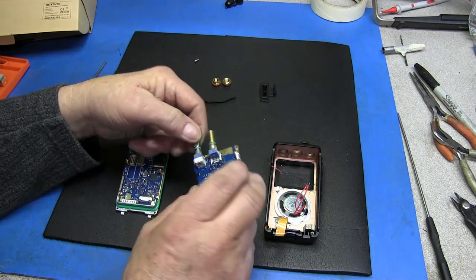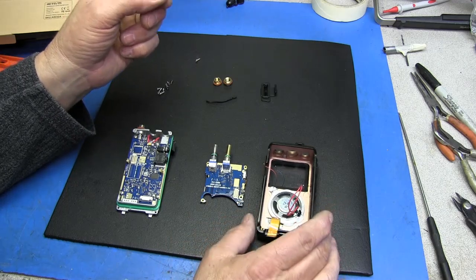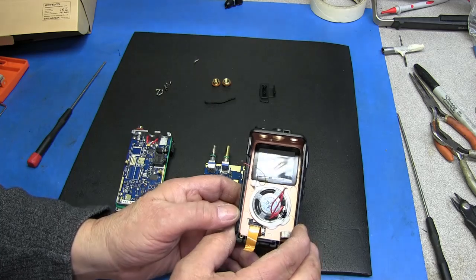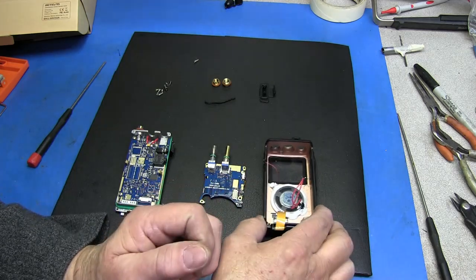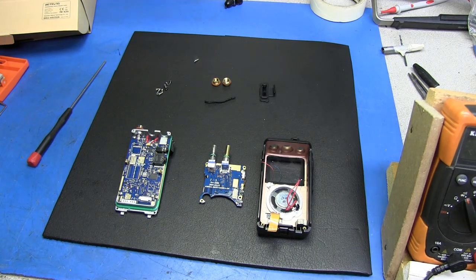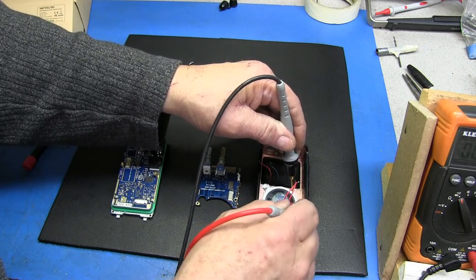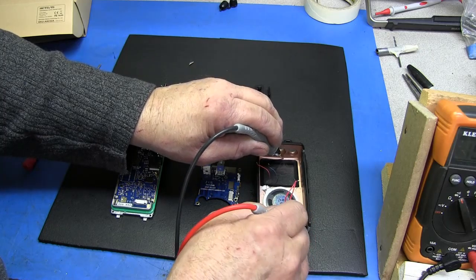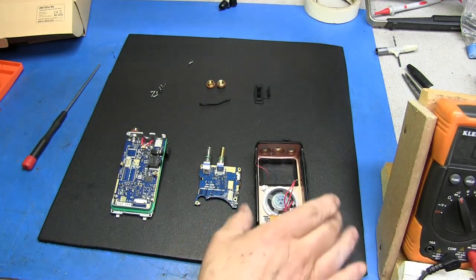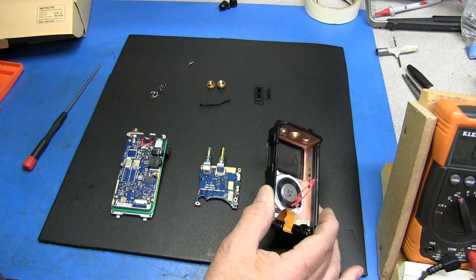One thing you'll note is that this housing is plastic, but inside it looks like a copper coated material. That makes me wonder if it's conductive, so I'll take the ohm meter set on beep and see if this is conductive. I'll place it here and go down here - and as you can see, this is conductive. So they thought about that when putting it together, to help shield RF from inside this radio. They took the time to coat the inside of the case with a metallic substance to shield RF.